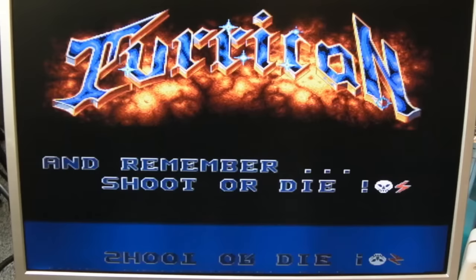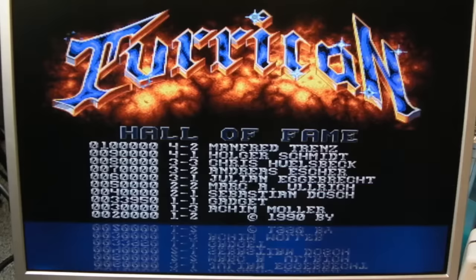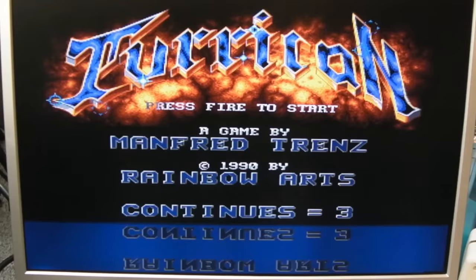Adjusting the clock tracking on this monitor — we've got rid of the jail bars. That flickering is the RAM, I think. For reference, the clock was at 50 and I've changed it to 90 — and the jail bars have gone. Consider me surprised. Typically with old monitors when I saw jail bars back in the day it was the cable shielding and impedance, but maybe that still is it. Either way I've got a way to adjust it on this monitor, and the lines have gone completely.